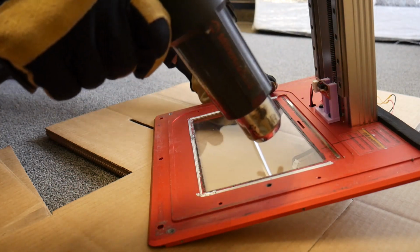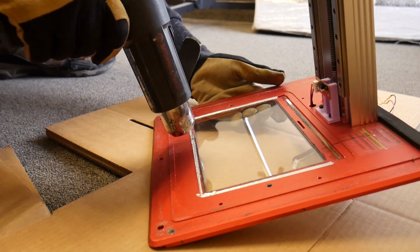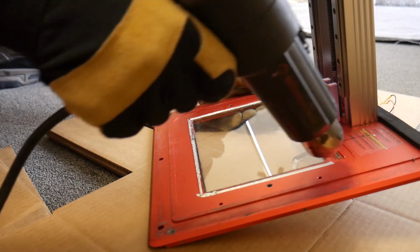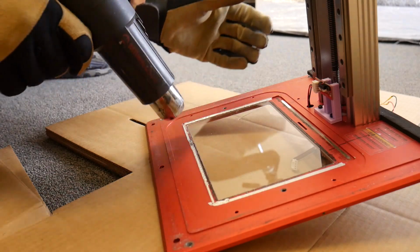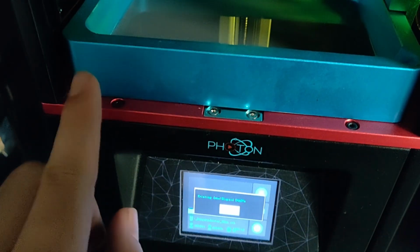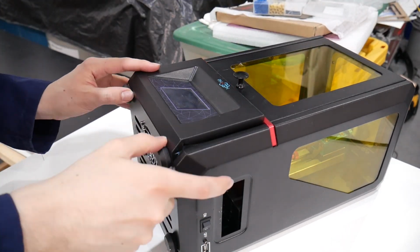But the bigger concern is the layer of underglass or under acrylic, as I'm hearing is shipping with some of the Anycubic Photons, can break or melt if there's a huge change in temperature. So carefully pry that screen off, discard it, do whatever you want with it. The next step is you got to open up the case. In the case of the Anycubic Photon, there's a couple screws you got to loosen on the top plate as well as in the case itself. That should allow you to pop the undercase open, giving you access to the control board.